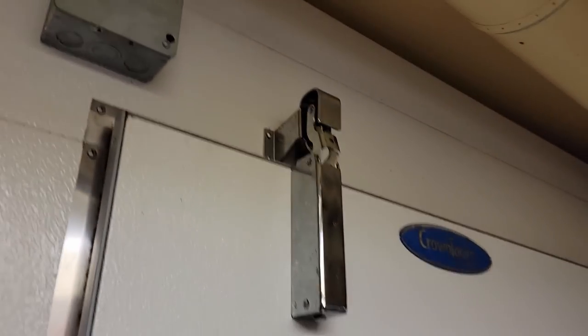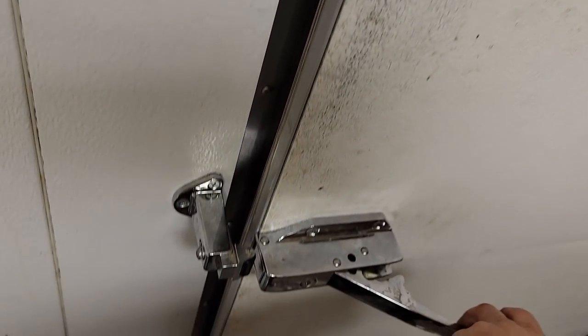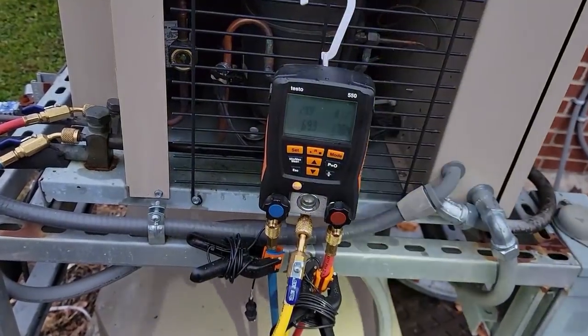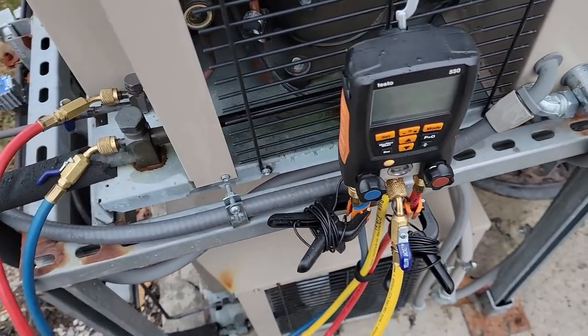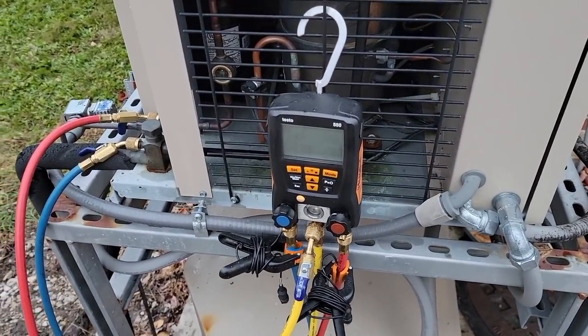You can see the coil is getting eaten up — they're just getting to the point where the coil needs to be replaced. The door closer needs to be replaced too. Even if you can get it to stay closed, it needs new door seals as well — it won't even close itself. You can see it there. It's snowing and we're in November. We're holding right in that 178 area — nice and good on the sight glass. Even though it's plugged up and building artificial head pressure, we're looking good. We're going to go down and verify it's getting cooler, which there's no reason why it wouldn't. If you ain't feeding solid liquid to that TXV, you're gonna have issues.